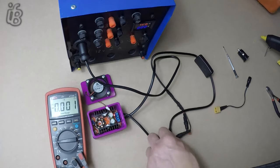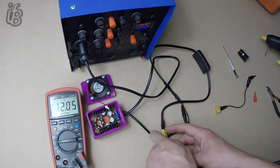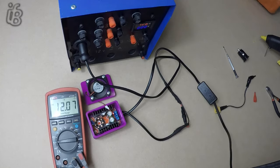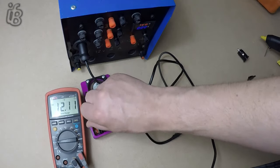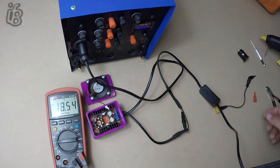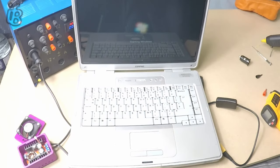Fan's working. I've got the ends there and I'm going to poke these in — it might go minus because I don't know which way I've got these around. There we go, 12 volts — yes, the right way around. So we're going to want to bump that up to 18 volts. 18.5 — let's do 18.454. That is now starting very slowly, but it is starting.